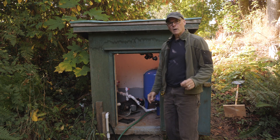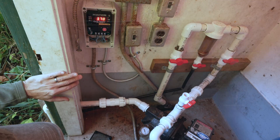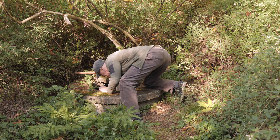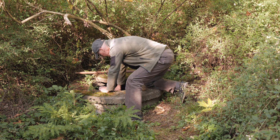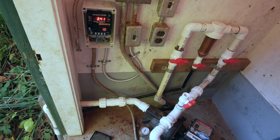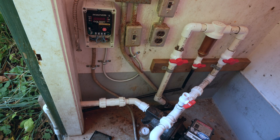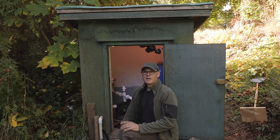Excellent — that worked out really well. I'm going to do a manual reset, re-prime the pump, and do another test to be sure. I'll pull the foot valve out of the well again. The pump shut off. The dry run relay works — it works really well. That's the solution I've been looking for. Thanks very much for watching everybody, we'll see you next time.